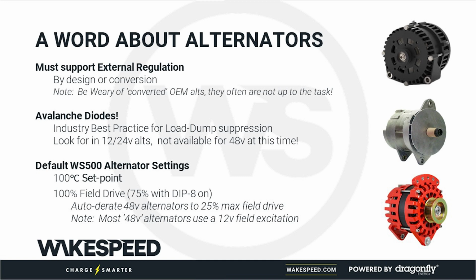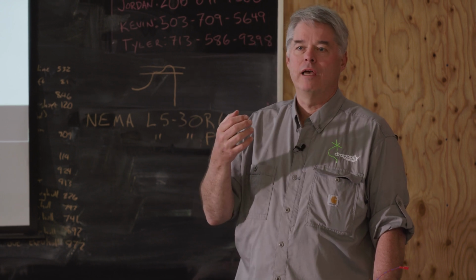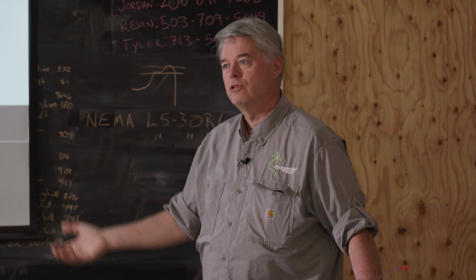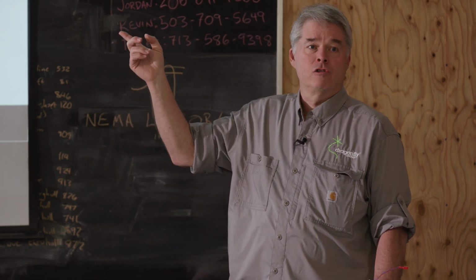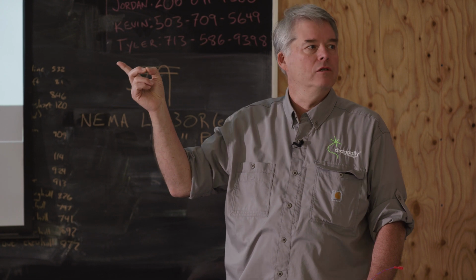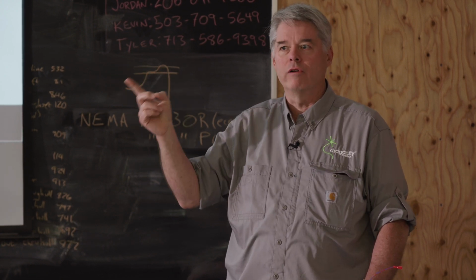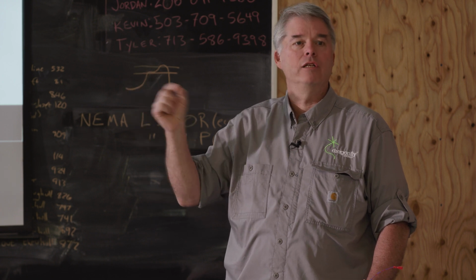Avalanche diodes, you're going to hear me talk about that quite a lot later on when things go bump. Avalanche diodes are a way to suppress high energy events in case of an uncontrolled disconnect. It is the industry best practice. There are people who will say, well, we just do this, we do this, we do this. The automotive industry decided that was the best practice in the 60s. I believe that it's still the best practice. And we have horror stories of installs that weren't designed correctly. The system wasn't engineered correctly.